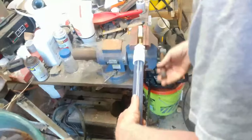I'm probably going to use 300 grams of carbon to remove the precious metals from the leach. I've got about 30 gallons of leach, but it was only used on 50 pounds of ore. We're going to move our tools over here so you can see what we're doing. This is the second batch of carbon. If you go to Chemex and look at their PDF about activated carbon, you will find all the information you could ever want on activated carbon.